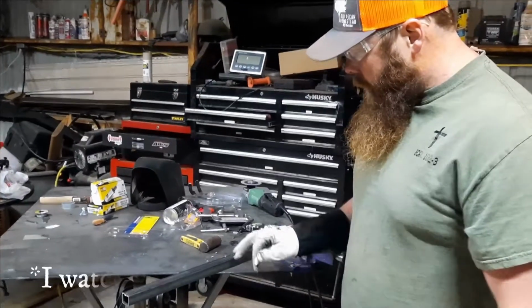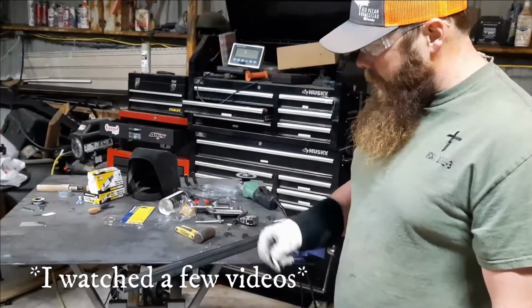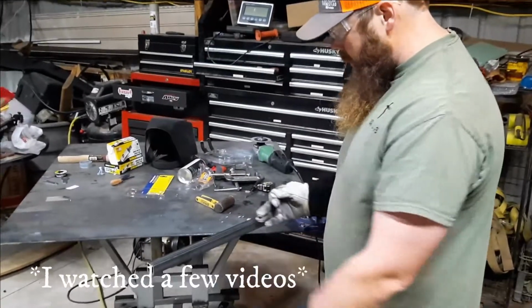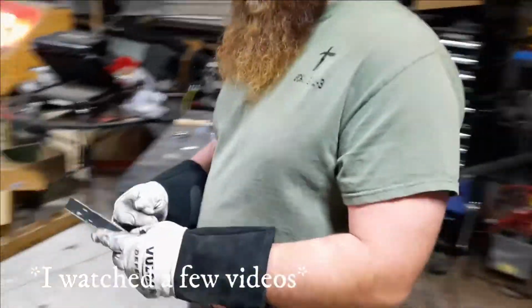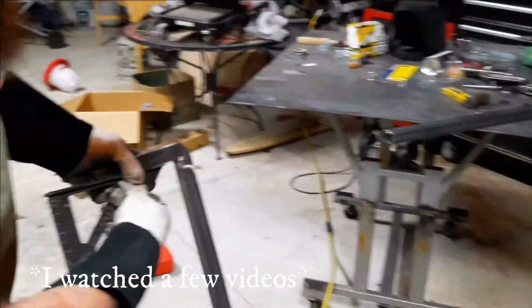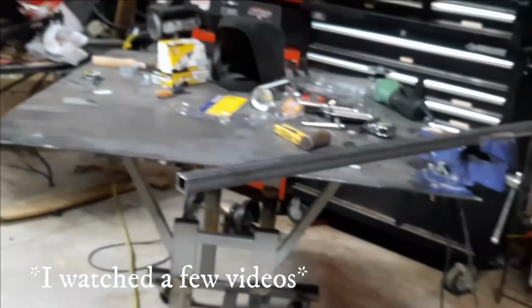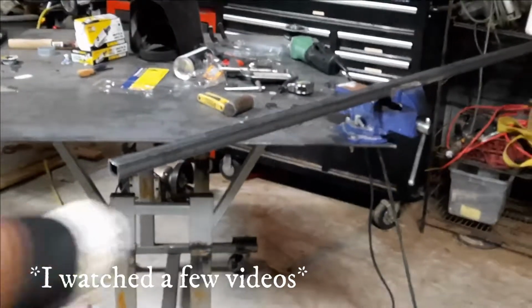Videos on this, and there's a couple things I didn't explain well, and I'm going to try to clarify that. So you're going to want to determine how far from the end of your tubing to the inside of your bend is going to be. And I'll grab this off the ground real quick and show you. So on this one that I've already done, the inside of your bend will be right here. So you want to determine how far from the inside of that bend to the end of your pipe is.